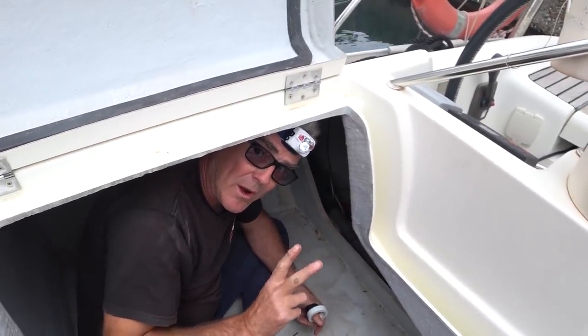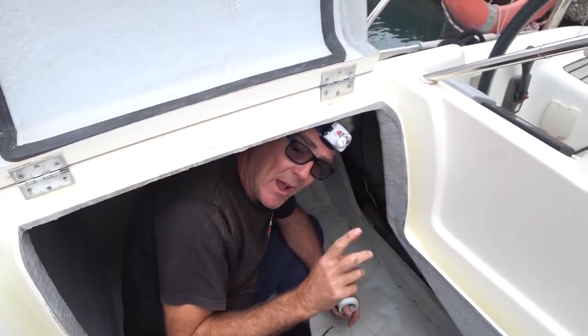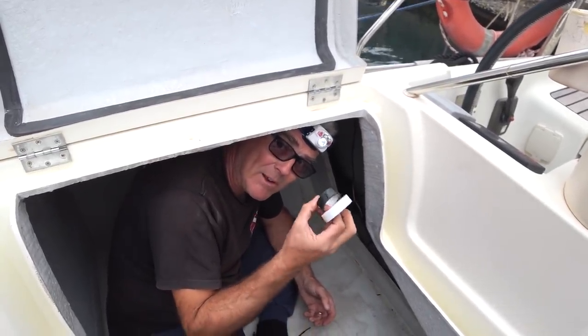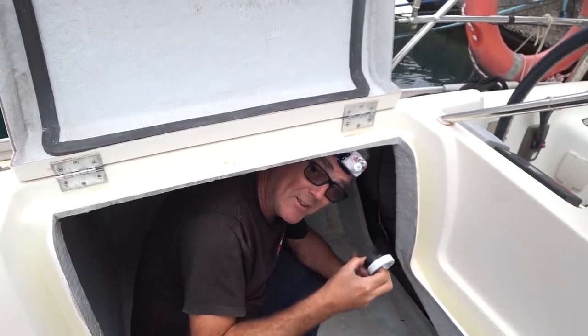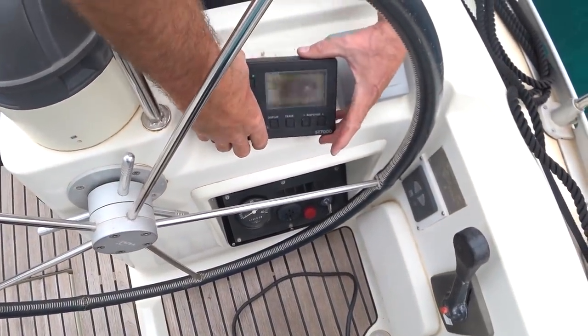In the back of the autohelm I can see there are two cables going in, probably a data and electrical cable of some sort because all of the instruments talk to each other. Because they're two and they're identical, I'm going to put different colored electrical tape around each one that I disconnect so that I reconnect the right ones when it all comes back together. So theoretically we should just be able to pop this right off the helm position now. The plan is to take this downstairs — I've got an exploded diagram from the manufacturer that tells me how to take it apart and put it back together again.